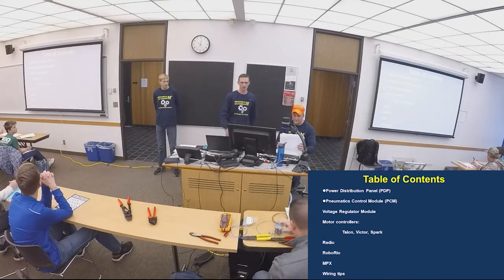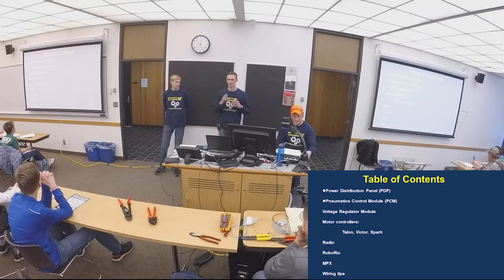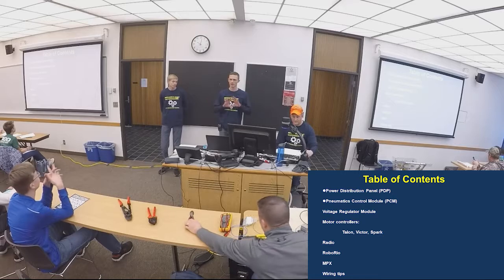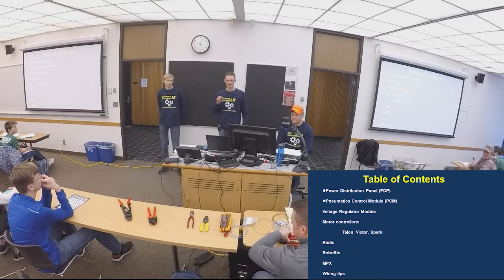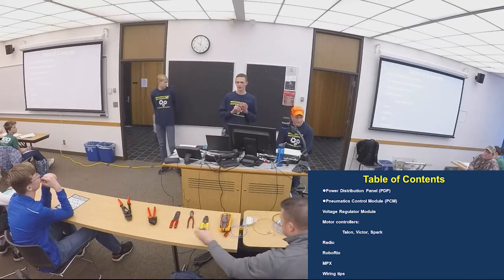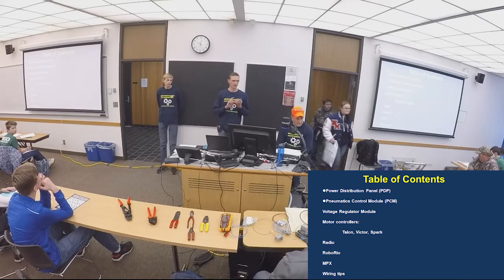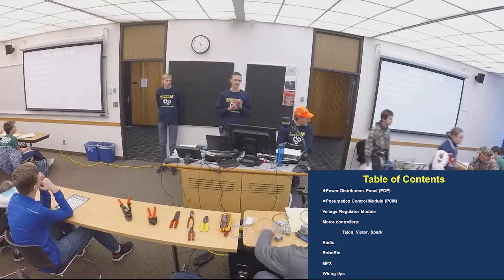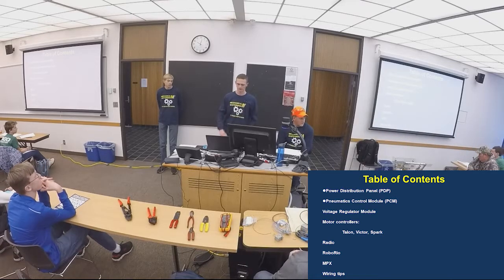All right, so we're just going to go over the basic overview of your electrical board. We like to make removable electrical boards that can come out of our robot completely. So this is going to include our power distribution panel, our Robo-Rio, our pneumatics control module if you have one, your voltage regulator module, your radio, your motor controllers, and your main breaker.